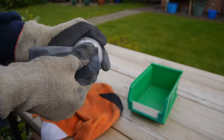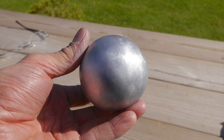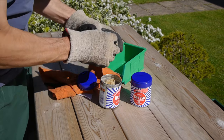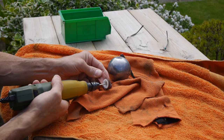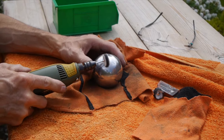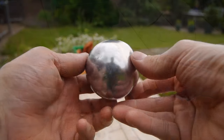I got to the point where I was getting a bit tired of all the sanding, and I felt further sanding was actually opening up little defects in the ball, so I decided that was the time to stop. Having done enough fine 400-grit sanding, I felt it was time to get things closer to the final mirrored finish stage. I had a couple of tins of Brasso hanging around and gave those a go — it worked really well, creating quite a good surface finish without too much effort. Finally I used some Jewellers Rouge on a soft polishing wheel attached to my Proxxon drill — it's a bit like a Dremel — and with a bit of effort this brought the ball close to a really good mirror shine. It was great to see it becoming more and more mirrored, and in the sunlight I could begin to see more and more of my reflection in it.